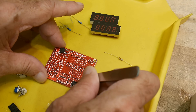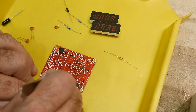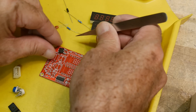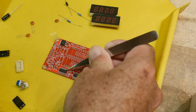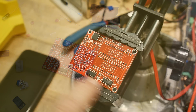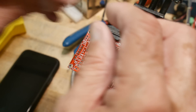Come on, these layout pads are not really good sized. I must have mushed the voltage regulator up there when I was reaching around. Did I do that? I think you guys did that. Let's put that in the oven and see how it comes out. Yeah, it's going to need some rework. I see a bridge here, maybe it needs a little bit of solder there. But for the most part it looks okay, so let's go ahead and put on some other parts before we rework it.